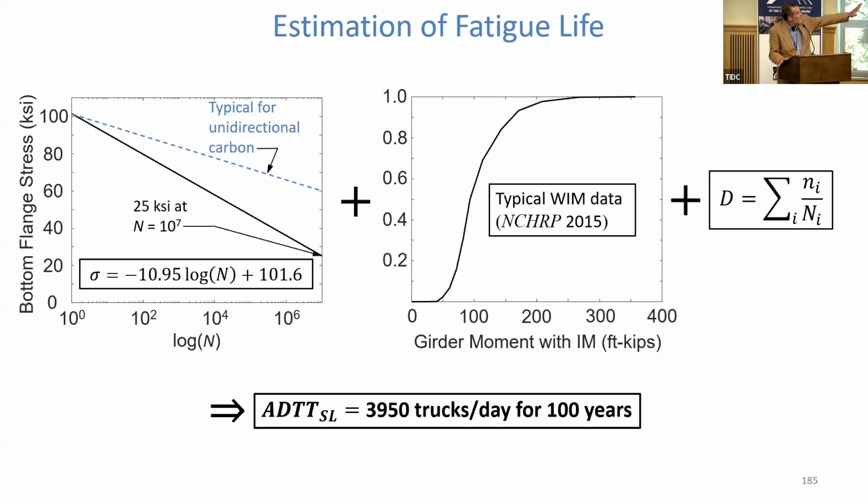If you look at the picture on the left, that is stress versus number of cycles. Because we tested 2 beams, I was able to derive, using Miner's rule, what the fatigue curve would look like. In terms of steel girders, you think of S-N, it's stress range. When we look at composite, we look at total stress sigma. That's the only difference. And the takeaway message there is that we can get that carbon up to a little over 100 KSI in its virgin condition, unfatigued.